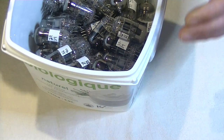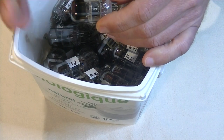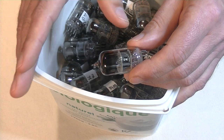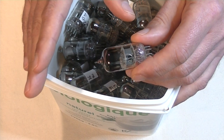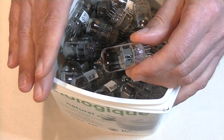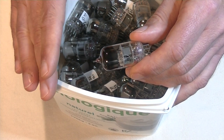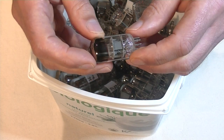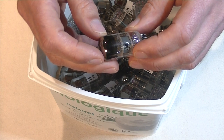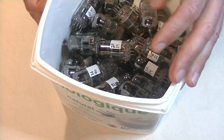Literally about a thousand Russian tubes came in. I'm working on a prototype phono preamp that uses Russian tubes — namely the 6N2P, though I'm experimenting with others. The reason is I wanted to try a new preamp design with a tube that's not the 12AX7, because nice testing, balanced, quiet, good-sounding 12AX7s have become incredibly expensive and hard to find. For most phono preamp stages you need at least a matched pair. The Russian tubes are sounding really good, testing good, and best of all, they're very affordable — so we've got a lot of those coming into inventory.